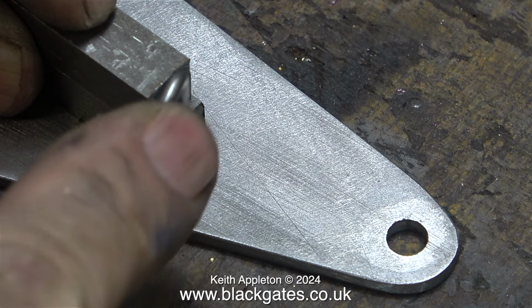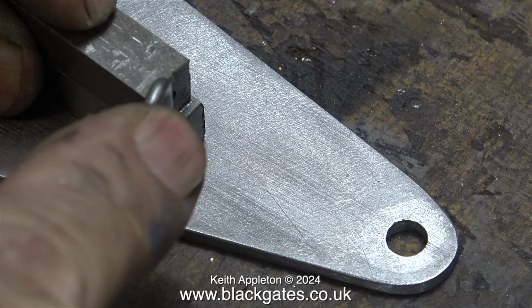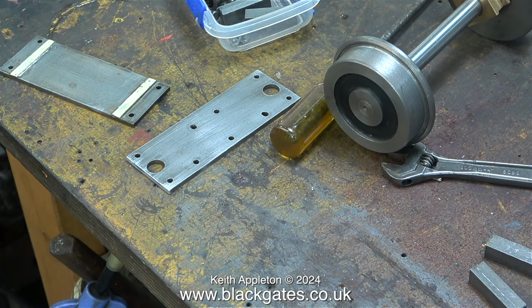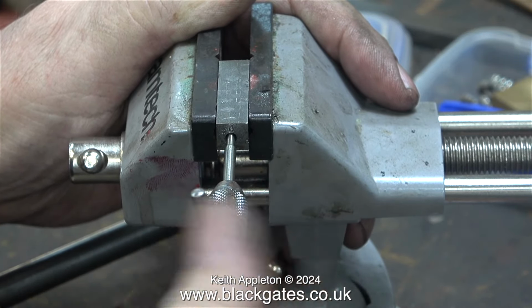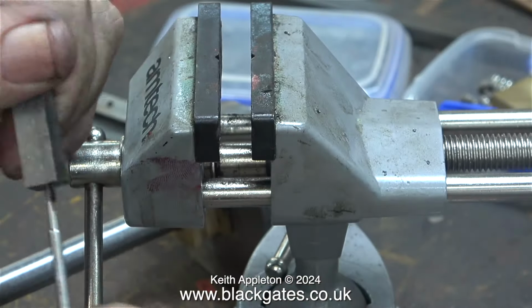I've machined one end flat on 4 of the pieces of bar that I cut from the long piece, and here I'm using one of the original guide bars to mark the finished length on all 4 of the others. Then I had a light bulb moment, a moment of pure inspiration. Why not just enlarge the holes in the top and bottom plates to allow a little bit of adjustment of the position of the bars? Then drill the existing holes in the existing bars deeper and thread them 4BA. This means that I can use longer bolts and the entire structure will be a lot stronger.